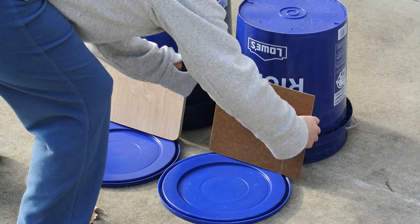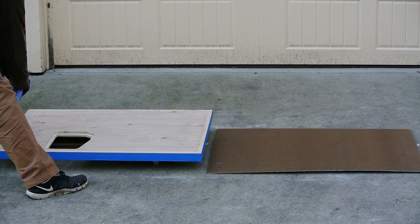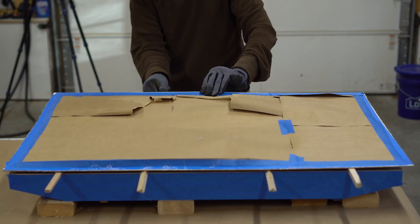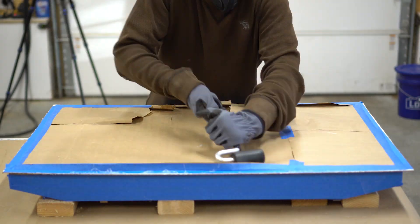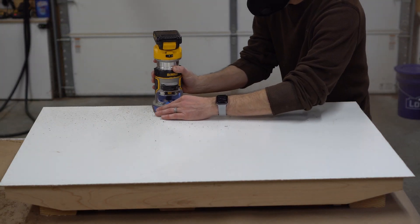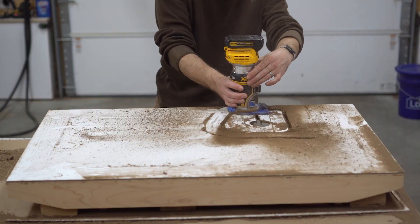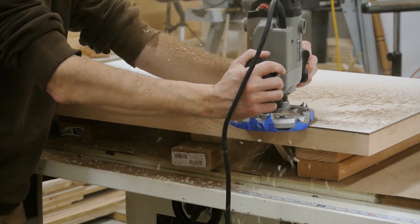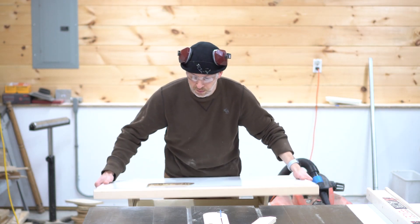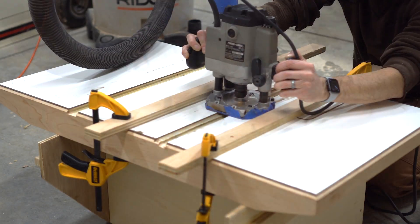Then I got started on attaching the hardboard. I'm trying out a spray contact cement from Loctite — I haven't used this before and it seems to work well, but I did learn that the overspray from the webbing is a bit messy. So when I sprayed the large pieces, I took the time to mask off the maple edging and the coated side of the hardboard with blue painter's tape and paper. I used thin scraps of wood to keep the pieces separated while I aligned them, and then removed the spacers starting at the middle and working my way outward. I applied firm pressure with a J roller to ensure a good bond, and then turned my attention to trimming the top board. I used a flush trim bit in my palm router to trim the outside, and then made an opening large enough for my router bit using a drill and jigsaw so I could trim the inside opening. I upgraded to my plunge router to add a large chamfer to the outside perimeter, but I failed to remember to attach my dust collection, so I still made a mess. With the top plate nearly complete, I placed it on the base, adjusted the height to be slightly lower than the table saw top, and then glued and screwed the supports that will hold the outfeed table at the right height. Finally, with dust collection attached, I used my router to cut the miter gauge slots.